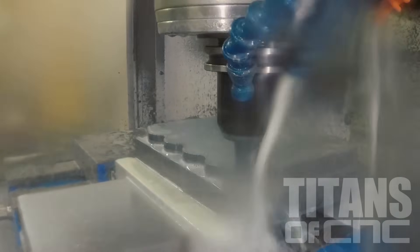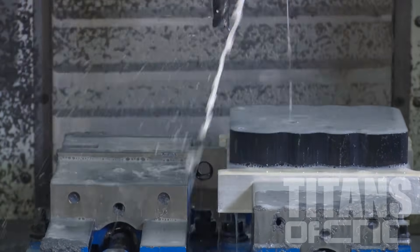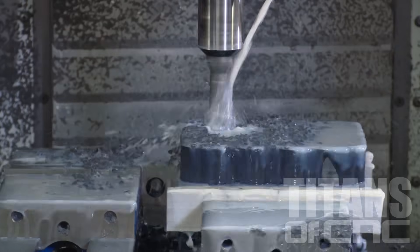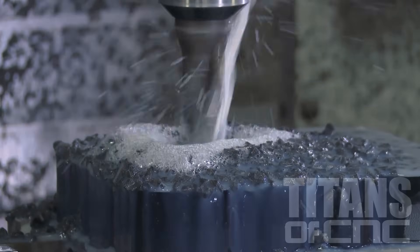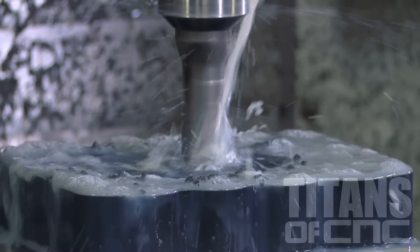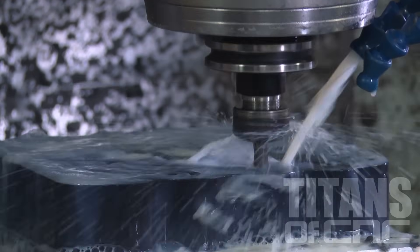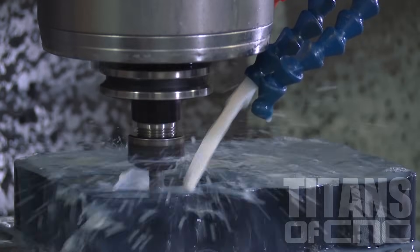We're going to machine the first off, cut the profile, establish the holes. If you really look at it, G10 is like fiberglass like on a surfboard, but they're layered up, stacked over and over and over, and then the resin just holds everything together. The glass layers make it extremely difficult to machine and keep tight tolerances. Basically this material is so strong that to cut it fast you actually need diamond tools so that we can cut through all the fibers.